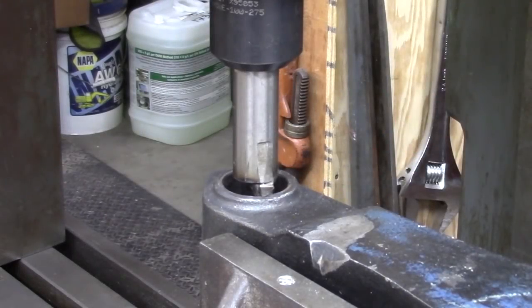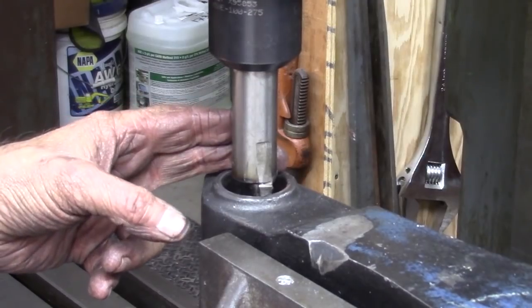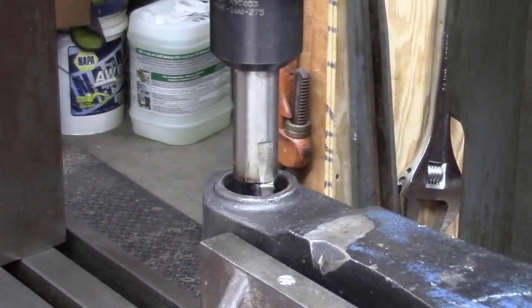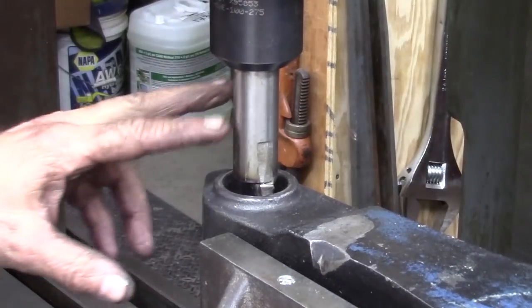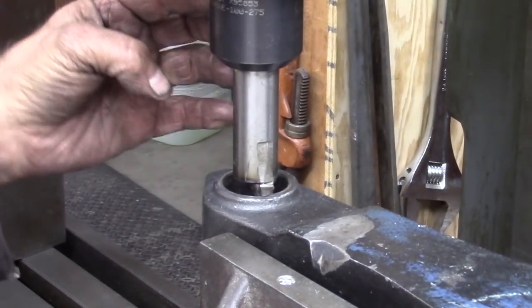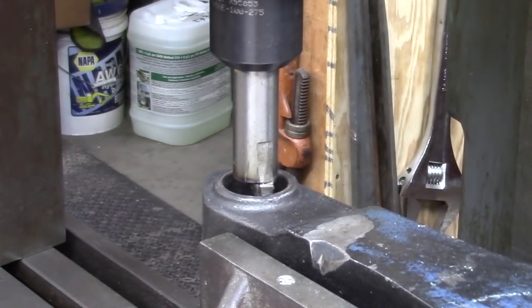Okay, so we've got our tooling centered, and so now all we have to do is make our first bore. When we finish with this bore, then we'll have to go back and change this bit to a longer bit so that we can bore the bottom one, because this bit isn't long enough to get down through both. So we'll have to pull this off. I'm going to leave the tooling in here because I don't have enough room to get it off. I'm just going to disconnect this, pull this off, then put the new tooling in it. And I may have to cut the shaft on it